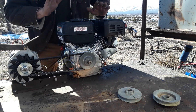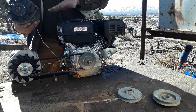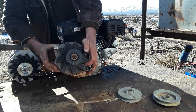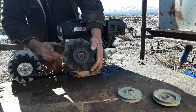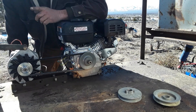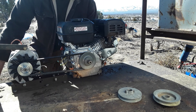What I did yesterday is I upgraded my off-grid battery charger. I've also shown another video where I use this as a welder. This is what I upgraded from — an SI10 Delco Remy, rated at 63 amps. I've been using this same alternator for a very long time, and I did manage to burn out the rectifier block on one occasion because I was using my forge blower for an extended period of time.